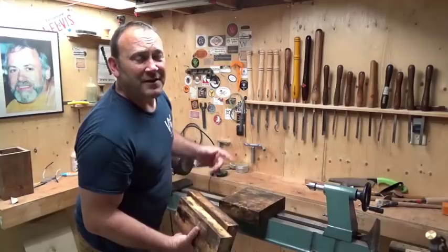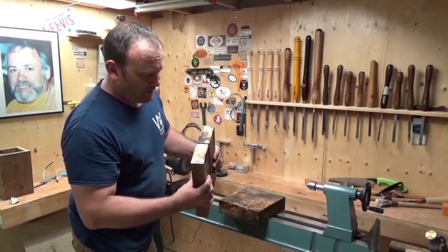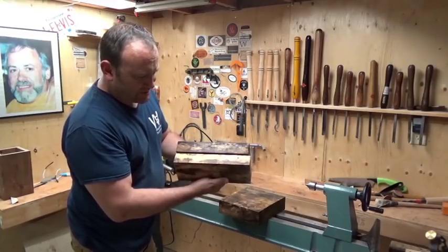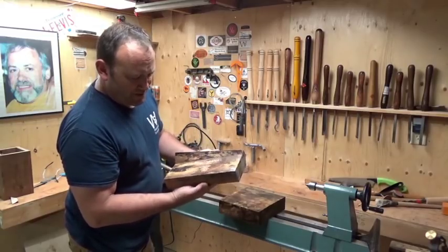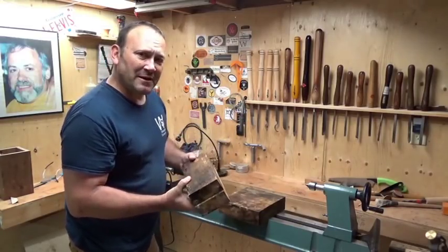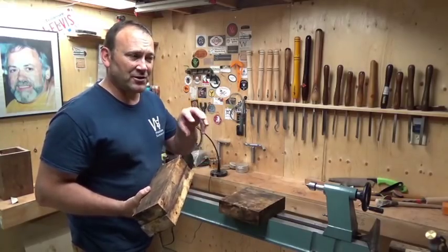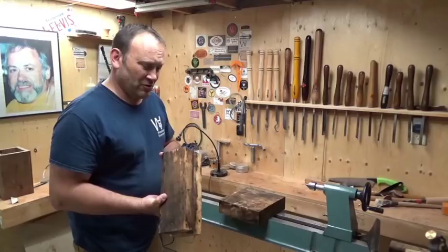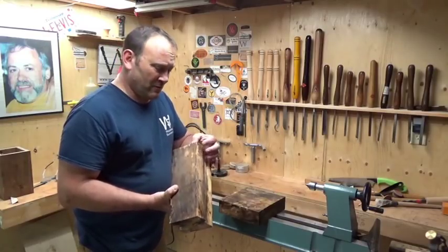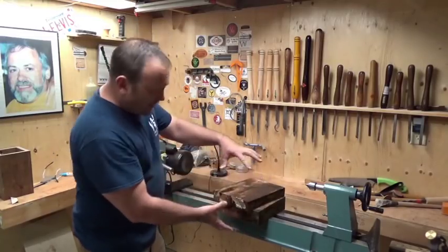I'm gonna have to refer back to the videos that I did previously in August of 2017 to remember what these pieces of wood are. I think maybe that this is maple as well, and I'm pretty convinced that this is spalted as well. And again, this was kiln-dried wood that I had. So you don't always get the best luck with kiln-dried. You really want something that's still got the natural sugars still growing inside the tree for the fungus to actually devour and create zone lines, which is what you're essentially looking for with spalted wood. But it looks like we might have some success here. And it's still hard. There's no punky. It's still rock hard, which is a good sign. So that, I think, those three pieces of maple.